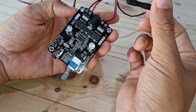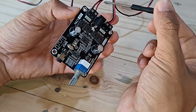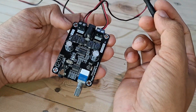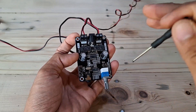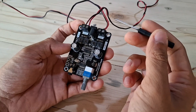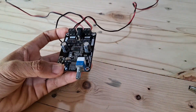My tip for this video: always check your speaker polarity when hooking it up to the amplifier. If your speaker is not connected properly, it may result in an out-of-phase sound. You'll notice it because the sound produced is not comfortable to your ear — it sounds unbalanced, not what you'd expect.